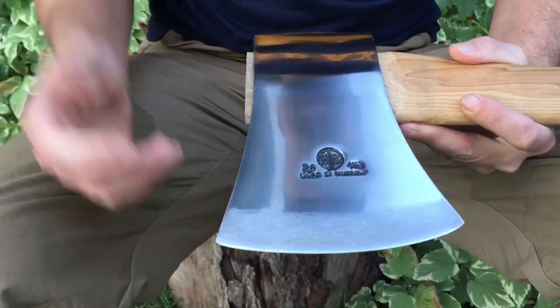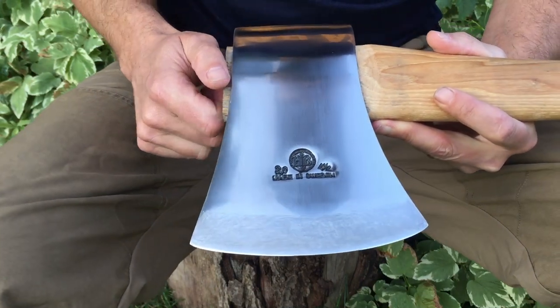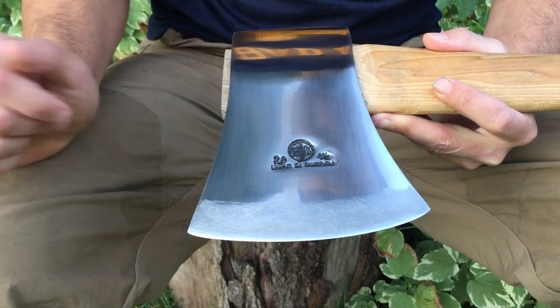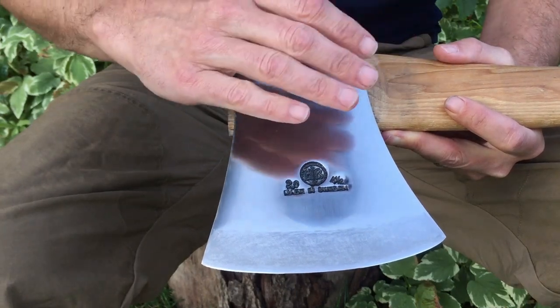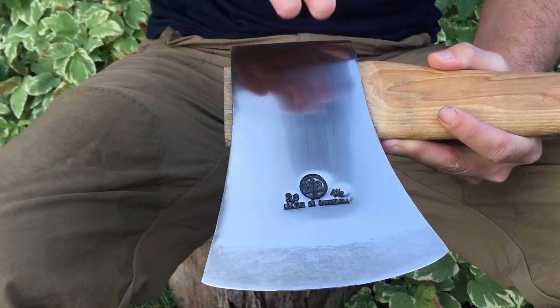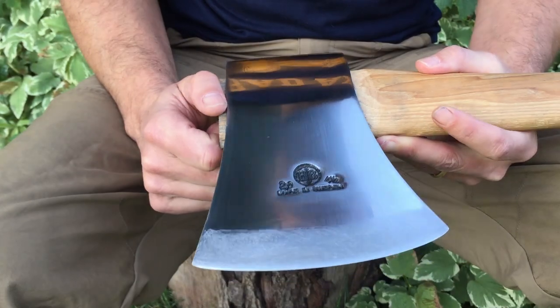I wanted to go for something that was different, but true to the spirit and form of this great, great axe. And so we've got a 23 degree full convex grind. We got a nice 800 grit satin semi-mirror finish. It's not a mirror finish. 800 grit, got lots of the striation going the right way. It's just turned out really nice.